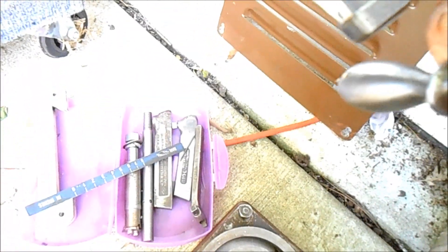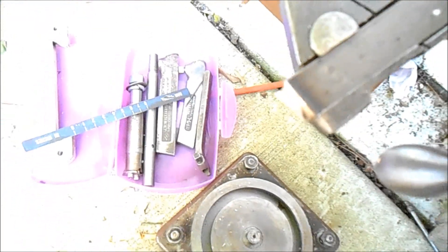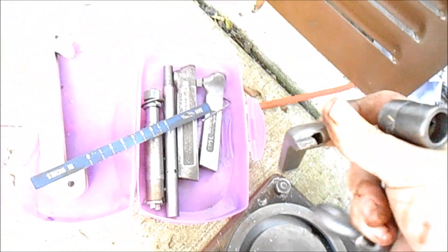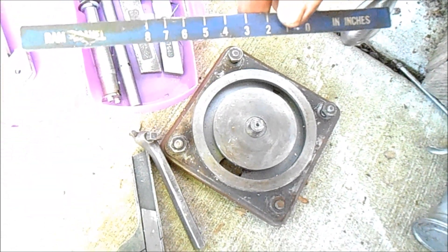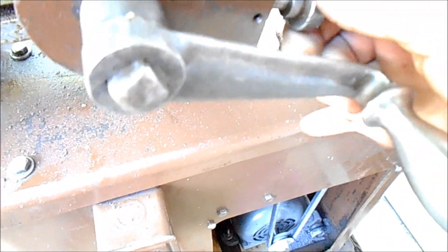I'm not quite sure how that's set up. It's got a couple of spring tools — this one's a neat one. I've heard people having problems sometimes doing grooving, getting chatter, and the spring tool ought to mitigate that. It's got a couple of lathe tool-holding holders, a long slender one, and it's got these two. It also has the original ram travel guide or indicator. Here's our wrench, and this will go on any of these.